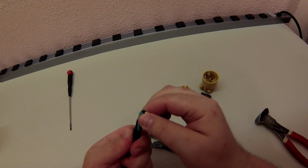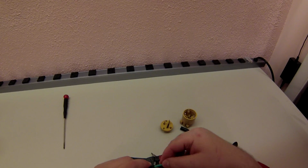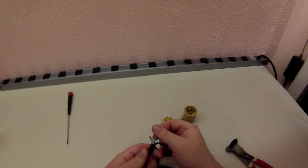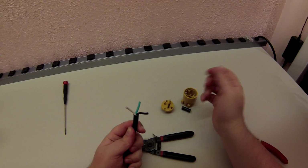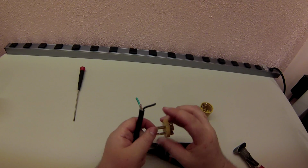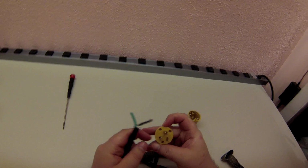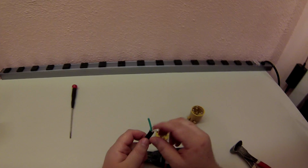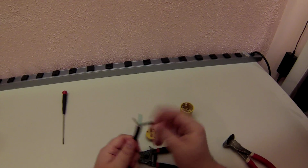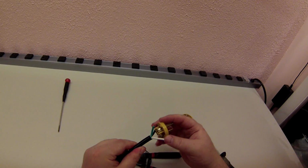Alright. Inspect. I crushed the insulation but did not cut it. So here we go. Now, green is ground, obviously, which is going to be this terminal here. And then this one's labeled W, which is nice of them, for white, which is not hot, it's neutral, and this is hot. Black, for some reason, is hot. Never really approved of that method.